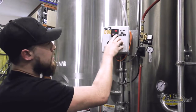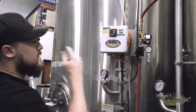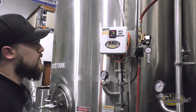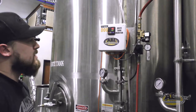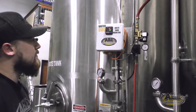Just for a quick demo here, say we want to maintain 5 psi feeding our machine — we can set it. You're going to watch how quickly that's going to be able to recover, because we are feeding with 30 psi. This tank's going to take just a little bit of time because of the excess headspace we have in here currently.